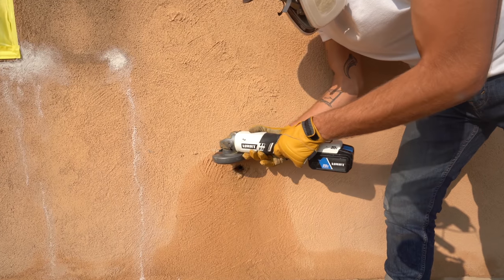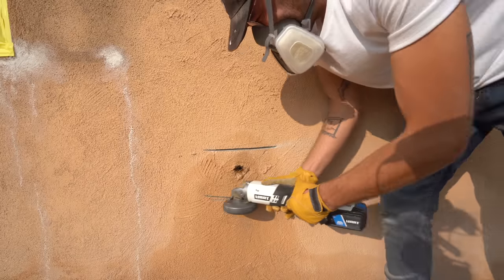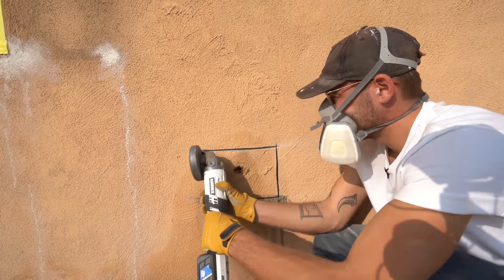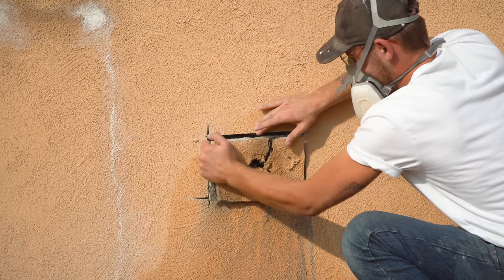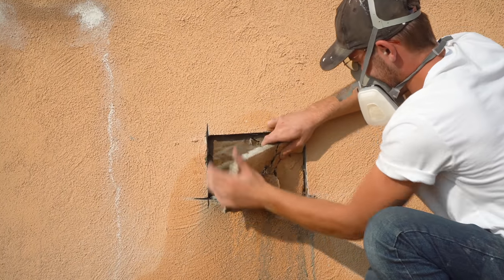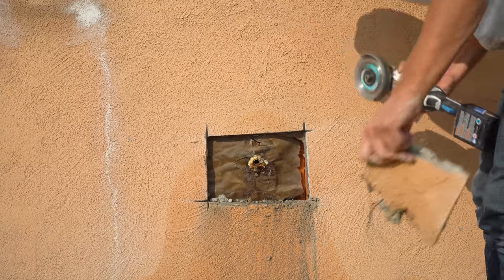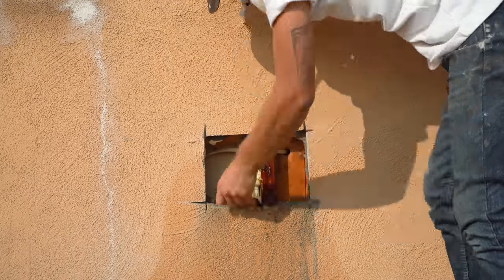You're going to have to fix and patch this anyways, so it's worth it to make a large enough hole so you have plenty of room to see what you're doing. I was happy to find that behind my wall, I had a pretty typical setup — just some insulation and a copper pipe attached to my stud. And the best part is the copper broke far enough away from the elbow that I'm going to be able to solder on a new fitting easily.